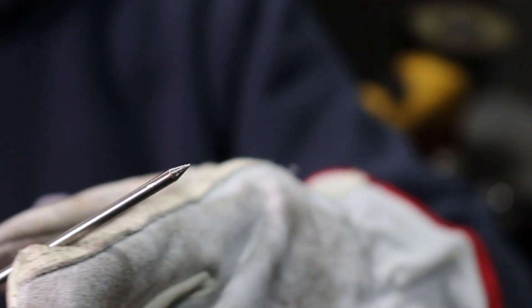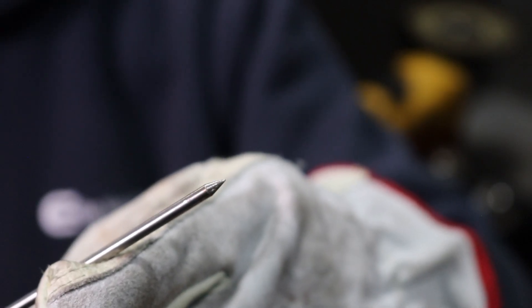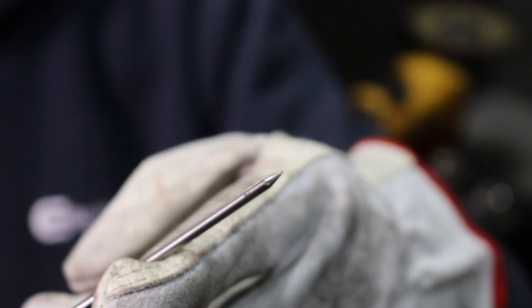As you can see, we've got the other end sharpened. It took a little bit longer with an angle grinder — bench grinders are a little more efficient. We recommend a bench grinder; it's a little safer and a little bit faster. But typically out in the field, this is how you'll be sharpening your tungsten.